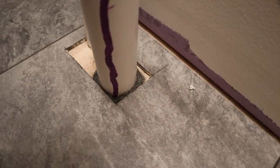We're ready to go ahead and put the vanity down over top of the pipes. Hopefully I cut the hole in the bottom of the cabinet correctly, measured it right. And as you guys also just saw, I just stuffed a bunch of steel wool all around the edge of the pipes, down any kind of nooks and crannies, crevices out there. Guess any mice decide to make a little living, want to see what's going on up top, they can munch on that and die.